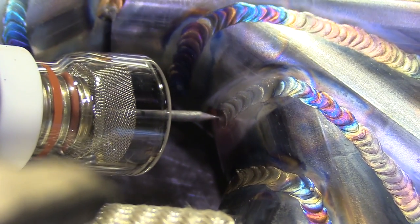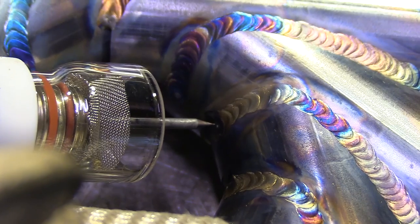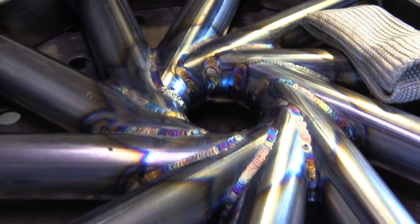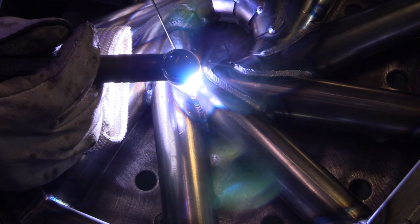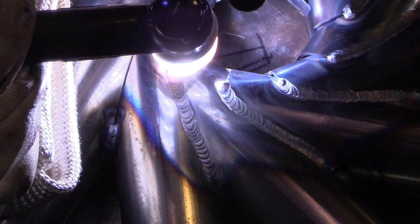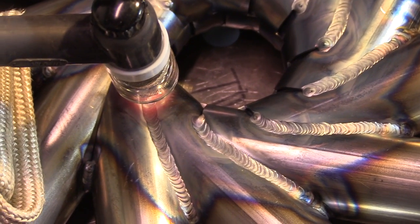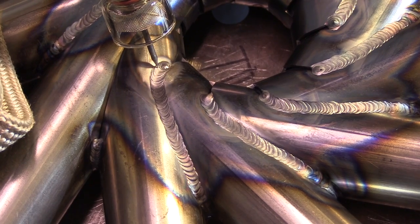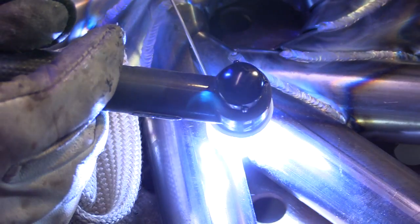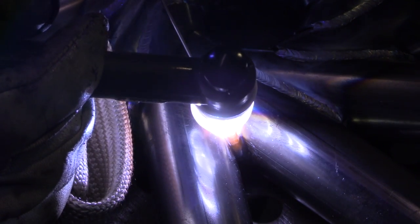You might be wondering: with so much welding on this, when you completely seal it off, won't it build up pressure and blow out? Yes it would. There's about a quarter inch of tab-and-slot on the inside holding this together, and I decided not to weld those little areas since it's going to be a wall ornament. If you were going to weld something like this completely out, you'd need to drill a vent hole or weep hole. Especially with aluminum — it contaminates and really ruins your day if it blows out.